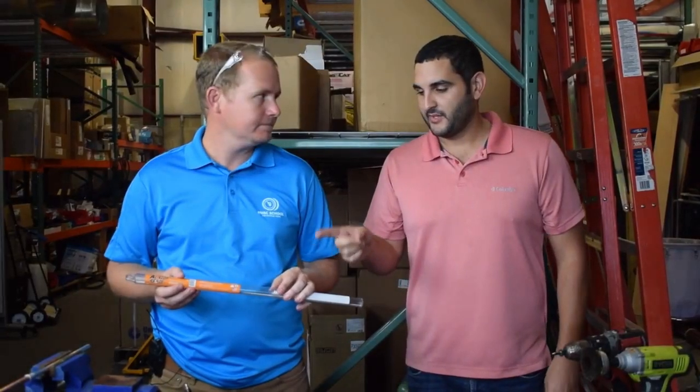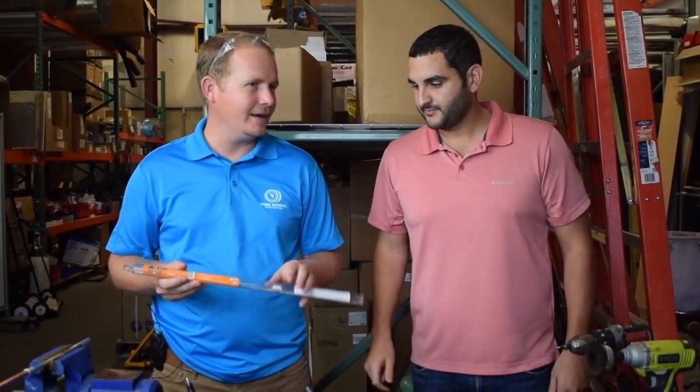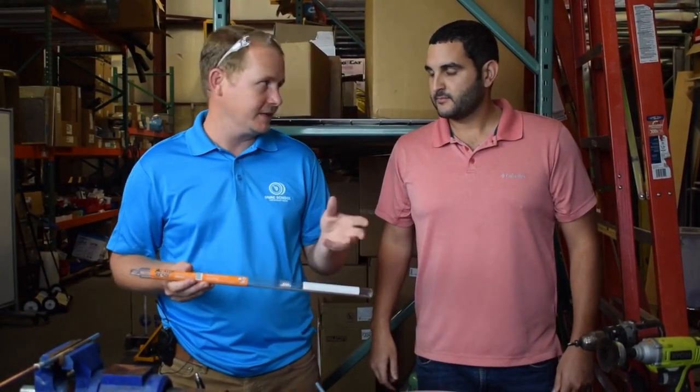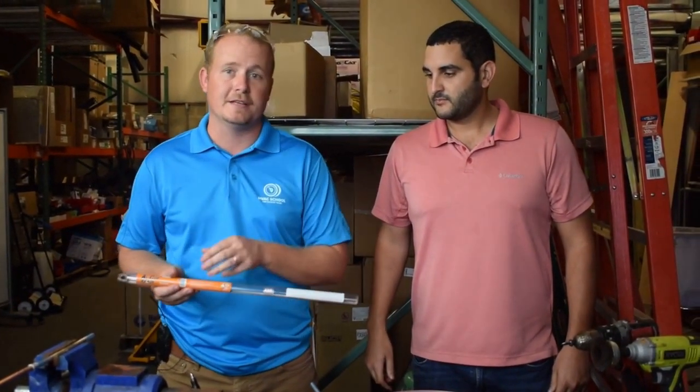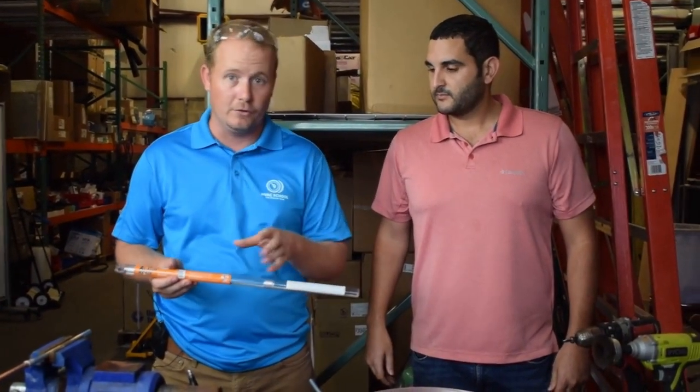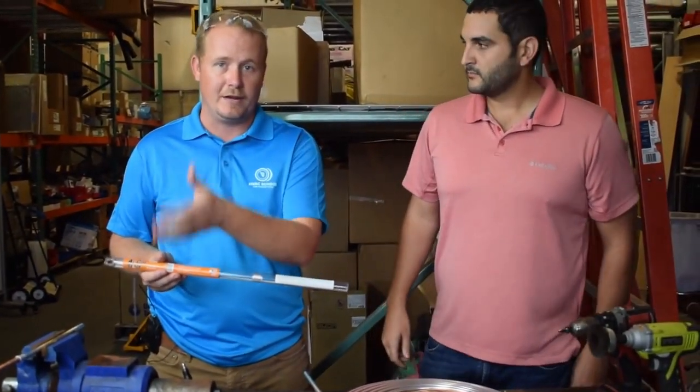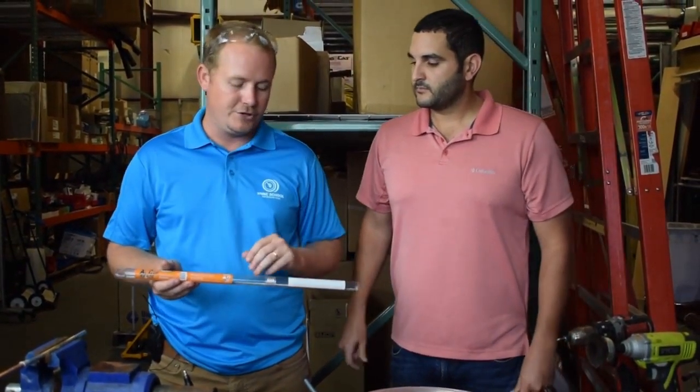This Alcop rod flows around what temperature? 950 to 1,000 degrees Fahrenheit, right in there. So it's in the safe zone for aluminum and obviously for copper. One of the big things you want to know is that you still have to be careful not to overheat the aluminum, but the easiest way to do that is to work with your heat primarily on the copper, and I'm going to show you how that's done.